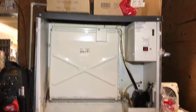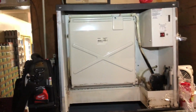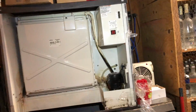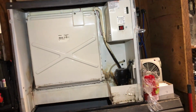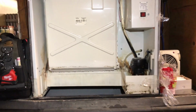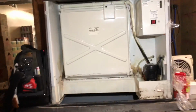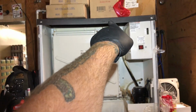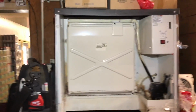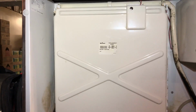So let me give this customer the quote for all the repairs this needs, and it's not cheap when you get into everything. So we'll see what they want to do. But that was tonight's ice maker call. Piece of slime stuck up in the ice thickness probe because it got all slimed up. Very common. Alright, we're in harvest. Let's see what happens here.